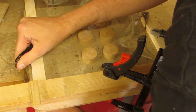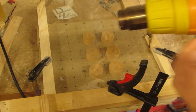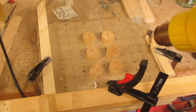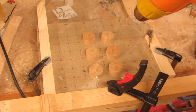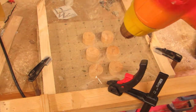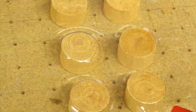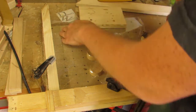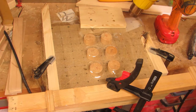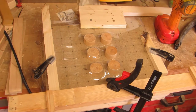Clamp the plastic to the vacuum table using a few sleds. You can and should also use the clamps holding the table to your workbench to help hold the plastic. You probably need to wrangle the cold plastic a little, but once it's hot it'll give. For that we use a hot air gun, and at least for the plastic I'm using, setting it to its highest setting works best. Connect the vacuum hose before you start, but do not run it yet — otherwise the airflow will cool the material too much. Now warm it up until it becomes flexible.